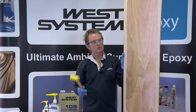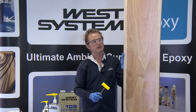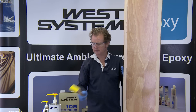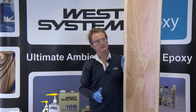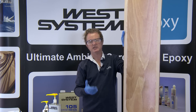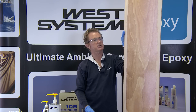You can see how much of a difference that makes. From this point I would want to add a third coat and possibly a fourth to ensure I've got enough substantial coating so that when I come to abrade it I don't go back through to bare wood. Coating is very straightforward, but I would suggest that anyone who has never done this before has a practice on a small scrap of wood first — that's really good policy.